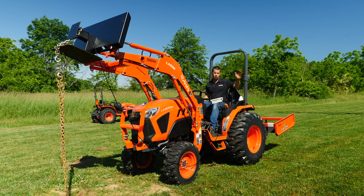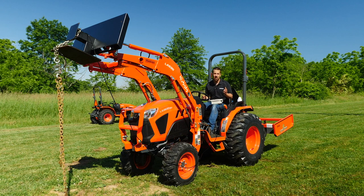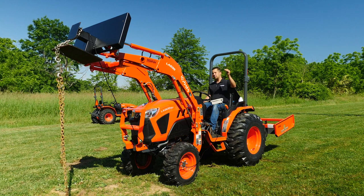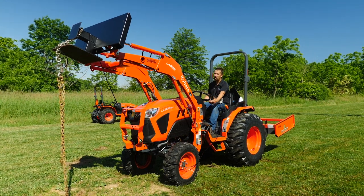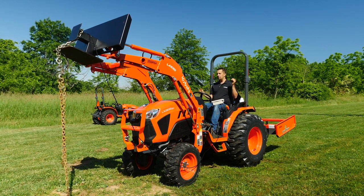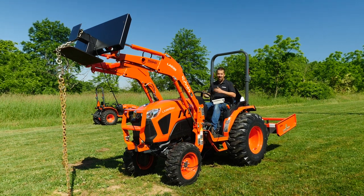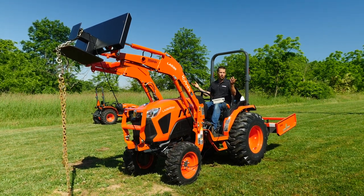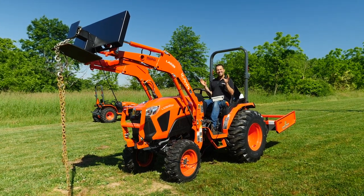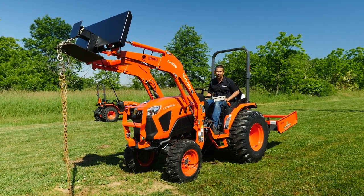When we compare to the other tractor, Kubota says these two loaders are within 15 pounds of each other at full height. My suspicion is that when we come down to lower heights, we're going to find the bigger loader on the L3901 being more capable, and that's due to the complicated geometry of loaders. At different heights they lift different amounts — you can get different capacities depending on the position of your hydraulic cylinders. There's a lot more to what these loaders can do than what the simplistic numbers on the spec sheet show.